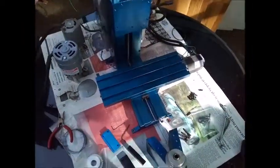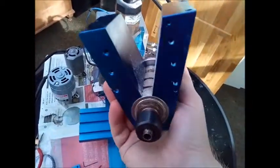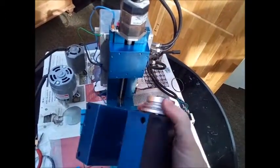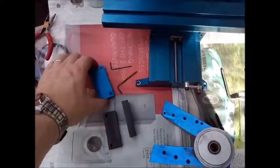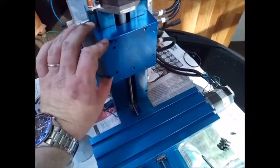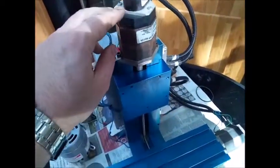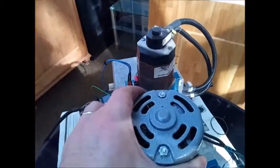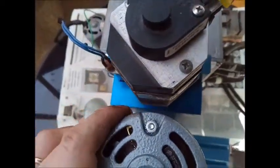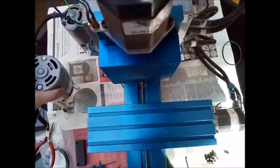I've got the head off and it's quite interesting — it's pretty heavy. You can see the bearings in there and how it all goes together. I've got to get this pulley off, which is kind of stuck on. These are the spacers that originally went up here and basically gave clearance to bring the motor off the stepper. The new ones will give more clearance, allowing the bigger motor to clear when moving up and down on the Z-axis.